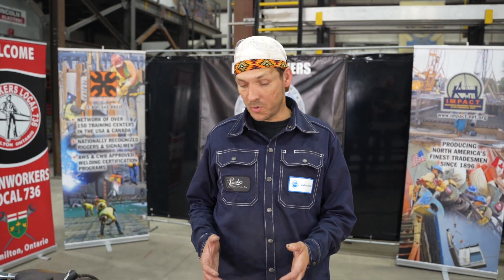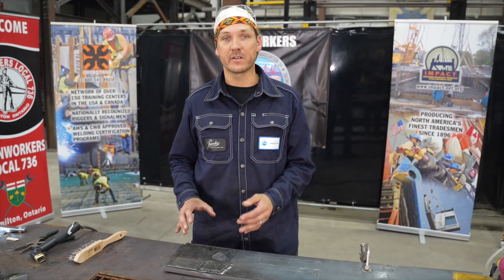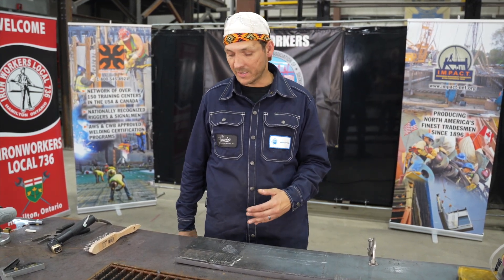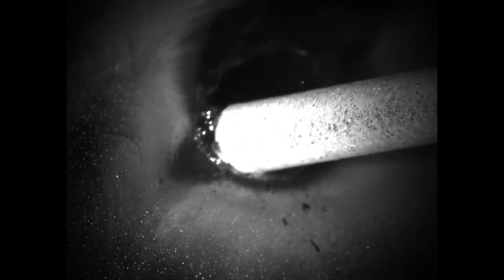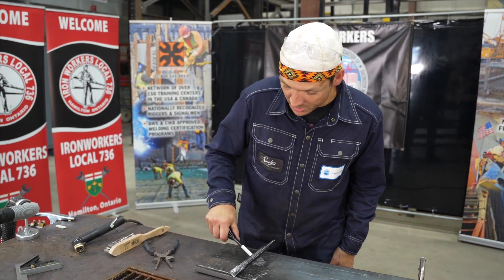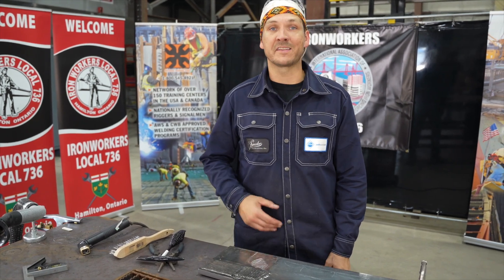Now I've been working hard at this and I'm almost done. Let's recap what we went through. We had our base metal, mild steel — we cleaned off the mill scale and any rust. Remember, if your plate is a little bit thicker, around one inch, even mild steel may need a little bit of preheat, though in this case we didn't. I inspected to make sure we had a nice flat surface, then I did the buttering layer with the 110-18 low hydrogen electrode, and then I came in with the hard facing rod. When I skate my chipping hammer across the mild steel, it almost digs in — it's relatively soft and I can scratch it easily. But when I go over to the hard facing area, the hammer slides right across. That tells me right there that the physical property is much harder because it's not digging in the same way.